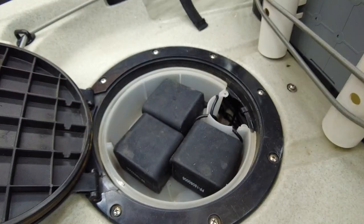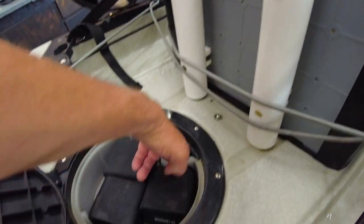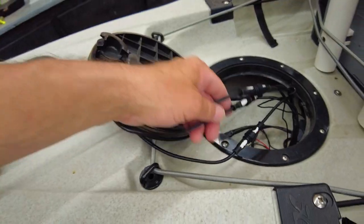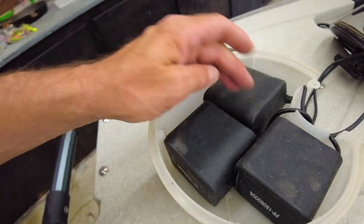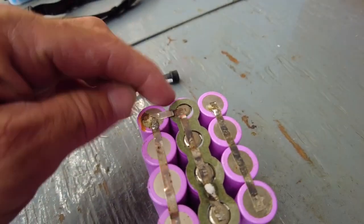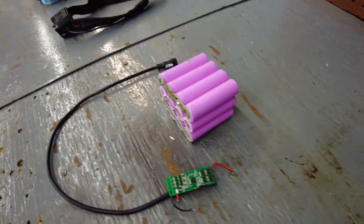Back here in the hatch powering the system, I have three NOCWA 10 amp-hour lithium battery packs wired together to make a 30 amp-hour pack. They're still wired individually so I can charge each one with its own charger or use them separately. I used to have a fourth one, but the first NOCWA I bought way back in 2016 finally failed. If you're curious what a failed NOCWA looks like inside, it's basically 18650 cells wired together with a power control module — the nickel strips corroded and failed, but the cells are still good so I'm repurposing them.